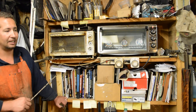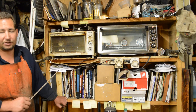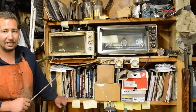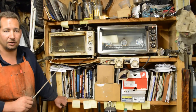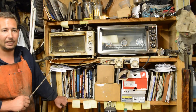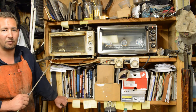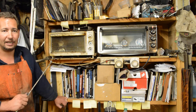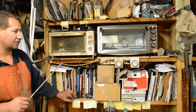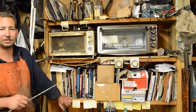Right after I built the oven, I decided to warm up a leather sheath for a chopper so that I could dip it in the wax. I set the PID controller for like 200 degrees over, say, 15 minutes or so. Went ahead and stuck the sheath in there, hit the go button, and about a minute and a half later I smelt this awesome awful smell. When that heating element fired, it toasted that sheath — right then, it was all over and done with. That was when I started thinking maybe those big powerful heat treating ovens weren't such a great thing for tempering.